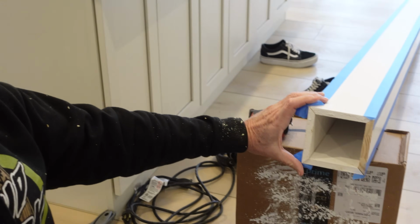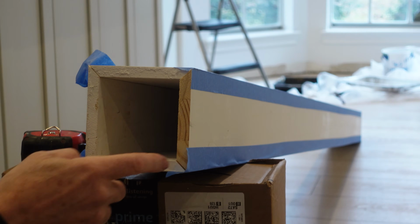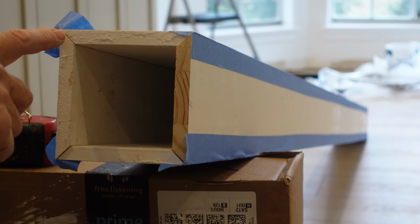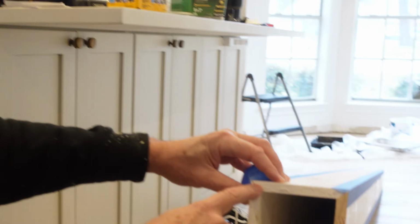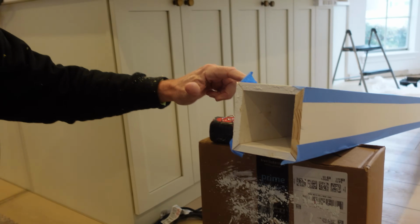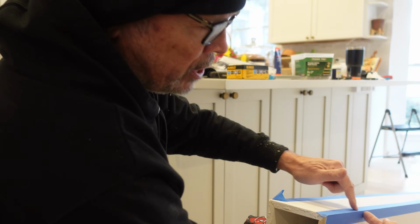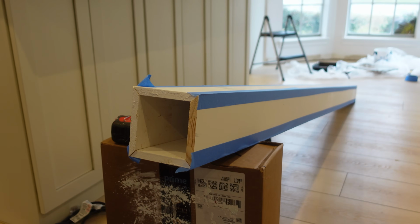All right, guys, got our column made. We used 1/2-inch baseboard material. It's finger jointed pine, primed, worked great. We set our saw blade to a little past 45. In other words, if you were to make these exactly 45, you'd be fighting these angles the whole time. We just got it temporarily dry fit, no glue. Once we glue it, we'll get a screwdriver, we'll burnish this edge, and we'll always be able to fill and paint any cracks, but I'm not expecting a lot.